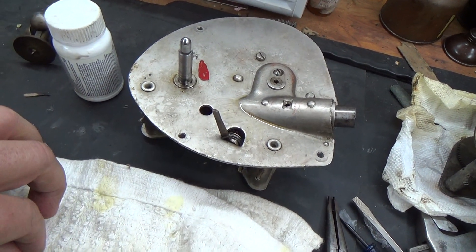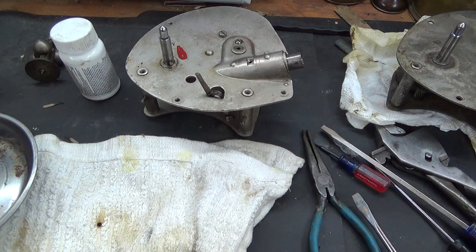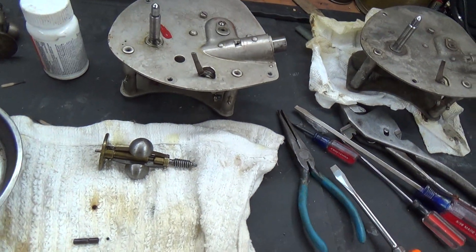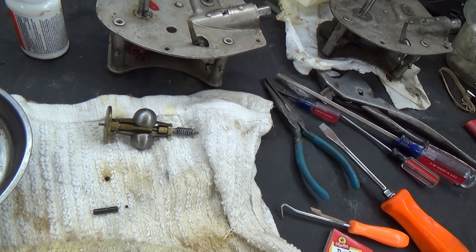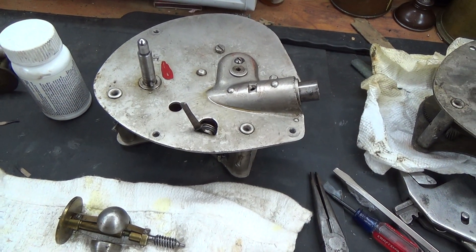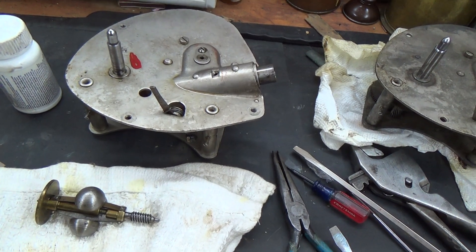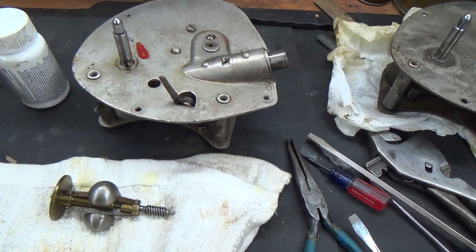They have to come out. The little channel inside has to be cleaned — and the heat cleaned it very nicely, actually. That has to be done, otherwise you're not going to be able to properly operate your motor. I know the temptation is to just leave it in there and spray some oil and call it good — you can't do that. I suspect I only have this problem on 102 motors because it's a more complex operation to get the motor board off compared to the 101.